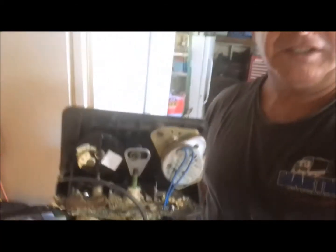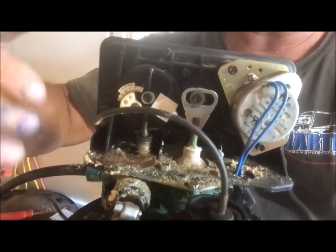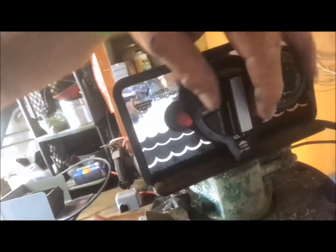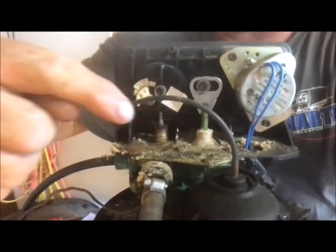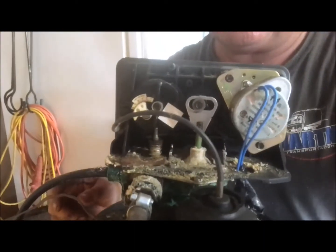This is the back of it. It's real simple. You make sure that you put the water softener in bypass, and I've got it disconnected, but then you want to come over here and turn your knob just like that to make sure you take pressure off of it, and you can see how hard it was to turn. Not to mention, you can see that it's been leaking back here, and that means some seals are gone.